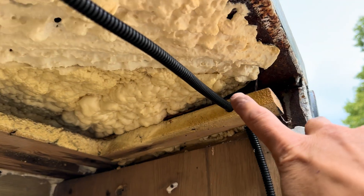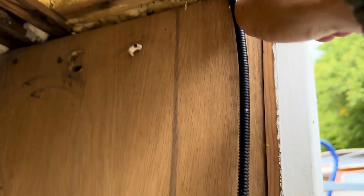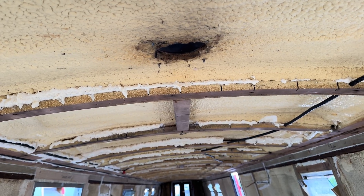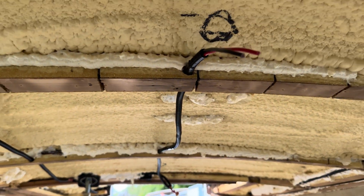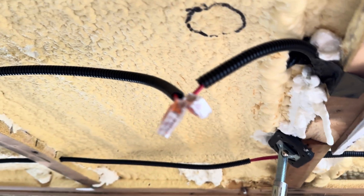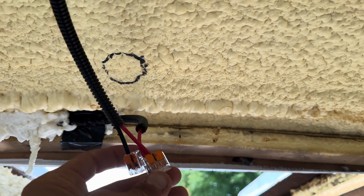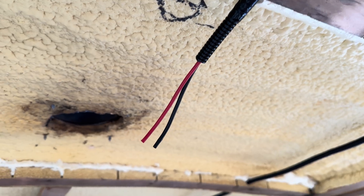First I need to bring in another positive cable here to join the L1 and L2 for the switch. There's literally no room in that conduit so I'm going to bring another bit of conduit in here - it'll come off here and go in the central position all the way down the boat, drilling through all this stuff. It's going to be daisy-chaining all the way down using Wago connectors. Now I'm going about putting in the lamp connections for the central line of cabling. I've drawn out where all the lamps are going to go on the ceiling so I need to make sure my connections are near those positions, with extra positive and negative tails so I can poke them through when the ceiling goes on.